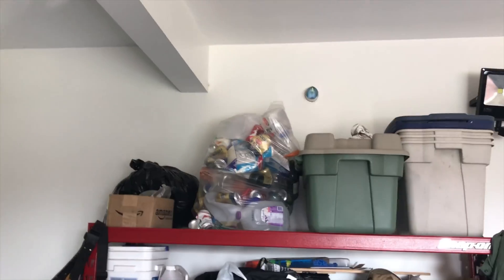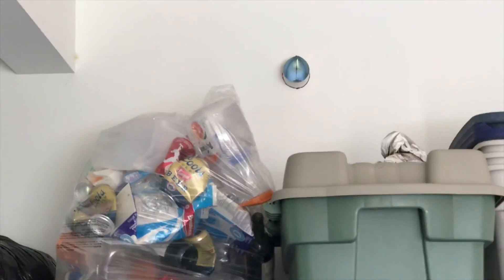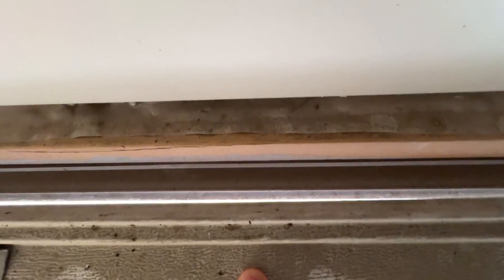When you pump air out you're going to need to replace it. I have a three inch vent pipe where I'll be installing the fan and that warm air will be exiting. The garage doors don't have a perfect seal, so the cool air from outside won't have any issues entering and replacing that warm air inside.